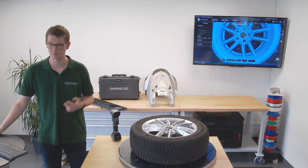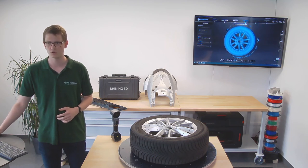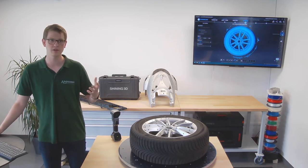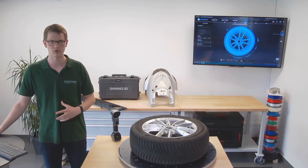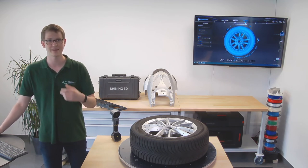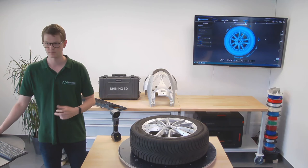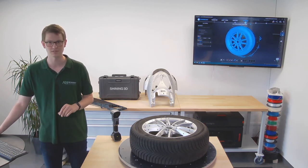The little music you probably hear is the scanner telling me that it's struggling — either when I'm too far away, too close, or it doesn't see enough markers. But I think this is a pretty good result now. For demonstration purposes, this is quite sufficient — you can see it has the nice tire profile picked up as well. The next step is to generate a point cloud, which will take some time depending on your computer's processing power. After that, you can mesh the model and export it as an STL. I'll start the process and be right back once it's done.